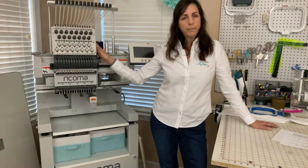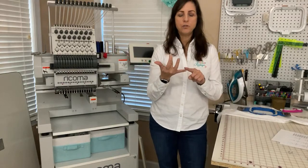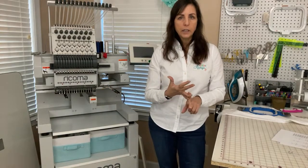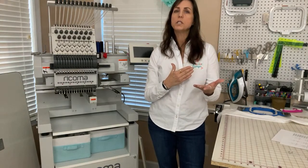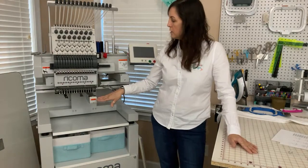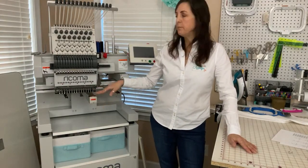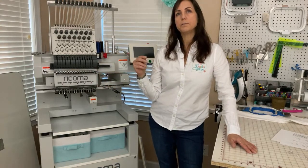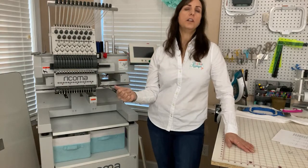As far as these machines are concerned, they teach you how to maintain them. You'll have to do daily oiling — usually just the bobbin — and then there's weekly oiling as well. It depends on how many hours you run it: if you're running 10 to 12 hours a day, you'll need to do more maintenance than if you're using it several times a week. There's also monthly oiling and then yearly.